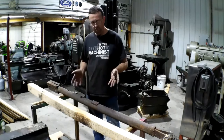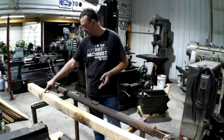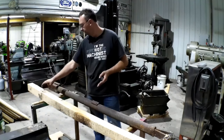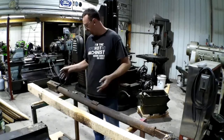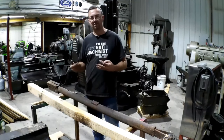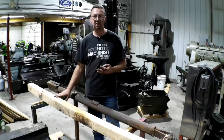One thing with oak: you don't want to set it down on anything steel, because it will stain — and it's already happened here where I set it down on the wagon and there's some blue staining. I'll bring the camera in and show you that. Then we'll get set up and start getting linseed oil on this — it's going to take a lot of layers. Let's get started.